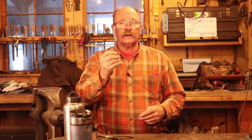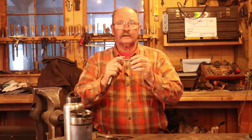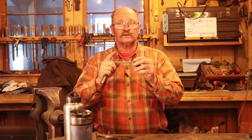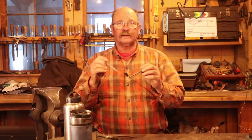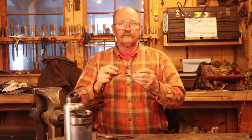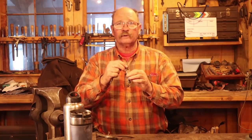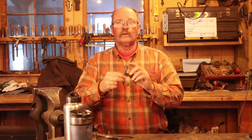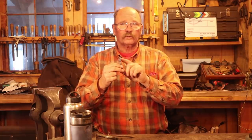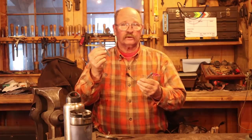We have a small piece of flat stock for the wing, and we still have the thumb screw attached to the rivet, attached to the pin that will hold the wing in, and I will cut all these things off and get them prepped and ready to turn into their final components for the next video. That'll just be cutting and a little filing to make sure the pins and the rivets are perfectly round, but we'll actually forge the thumb screw as part of the next video, so you get to see that, and we'll forge the wing into shape so you can see that.